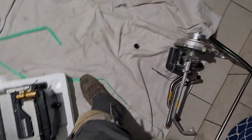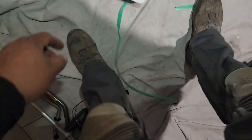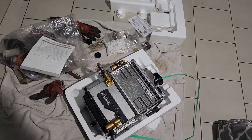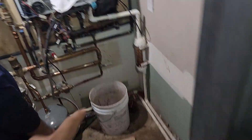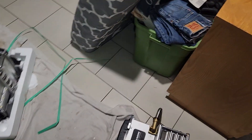Navien gives you a 10-year warranty on heat exchangers, so they sent this one out. It ran with those problems for about three or four years. Then I came and corrected the venting and the manifolds — the manifolds were wrong, the primary manifold was wrong.